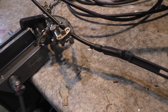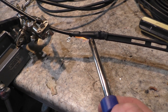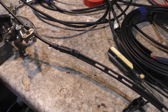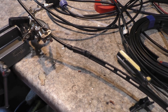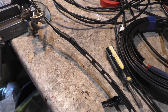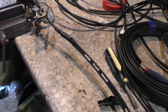I love this little antenna — it's really portable and really lightweight. In terms of signal radiation, if you're going up a hill for SOTA or something like that it has a brilliant radiation pattern. The signal goes out horizontally at a very low angle of radiation, which is exactly what you want when you're up high — you don't want it going up into the clouds.